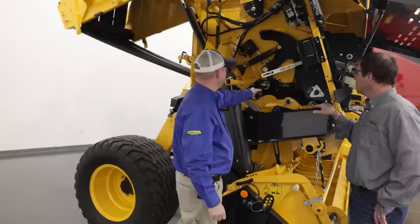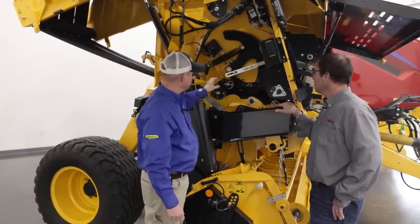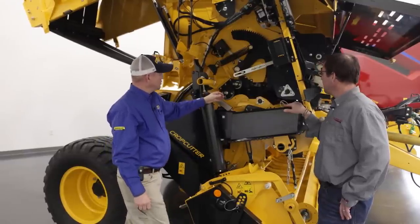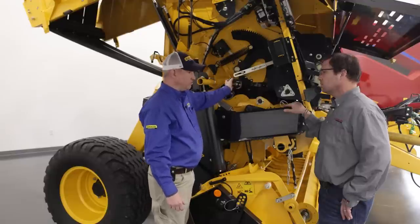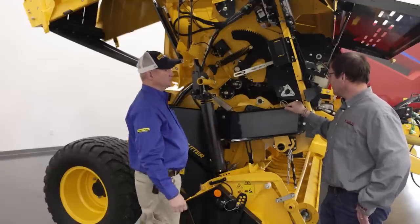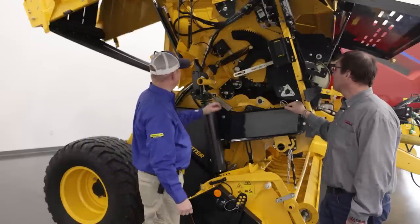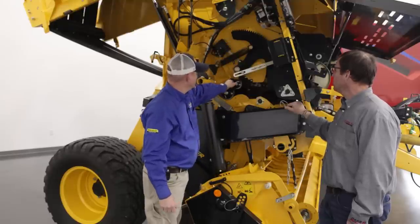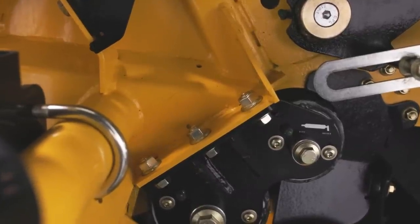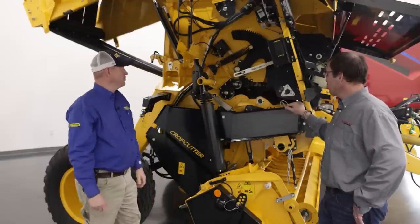The stripper spiral rolls right here — we still have those, but they extend out past the side sheets of the baler. The reason is that as we strip the material off the roll, we want to get rid of it and expel it. We don't want it to keep turning in the chamber, which would contaminate the belts and build up. For serviceability and maintenance, you can see those three bolts — you can unbolt that, unbolt the other side, and pull the assembly out like a cartridge. Work on it, put it back in, and be up and baling.